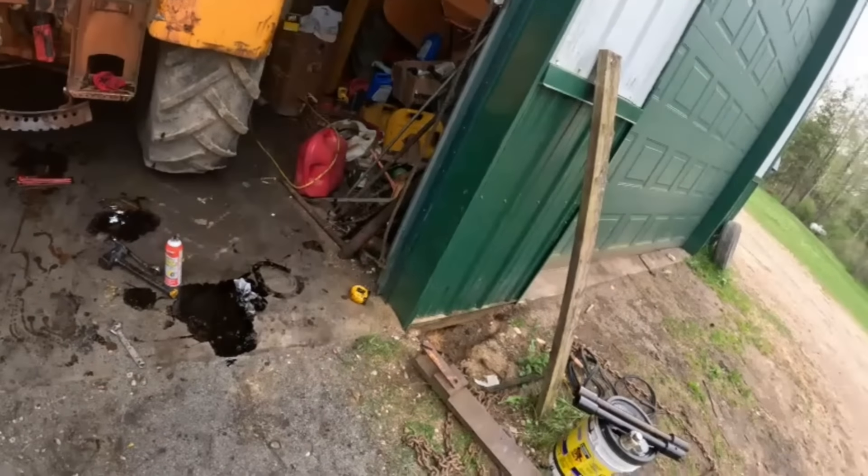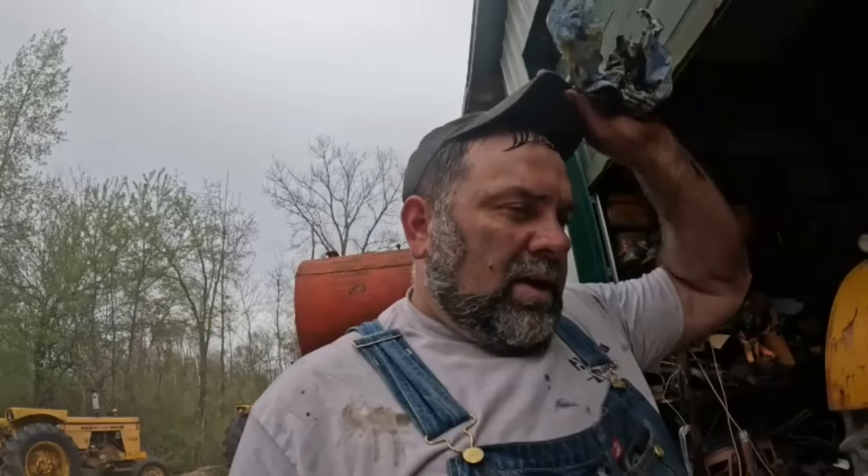I made a mess in the house — I was looking for my books and got grease on the floor. The missus saw it and wasn't sure if it was grease, mud, poop, or blood. She was guessing all kinds of things. Anyway, I was looking up part numbers. So lesson learned: don't use the ZA shaft if you're putting it into another Z. There's actually two part numbers for the ZA too — an early and late version. I looked it up on AGCO parts books. The G6 is the same part number consistently.